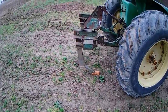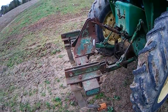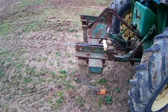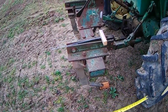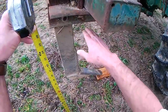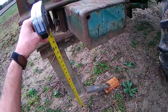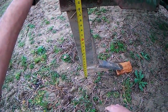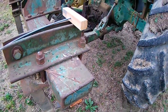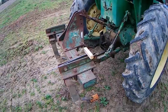What I'm looking at is a two-row ripper. It belongs to my cousin — he has loaned it to me and I'm going to use it this year. I was playing with this yesterday and had it in the ground. Running it all the way down looks like about 22 inches. The 40-20 in third gear had no trouble pulling it — probably could have pulled it in fourth gear.